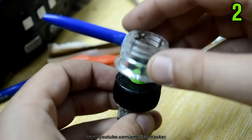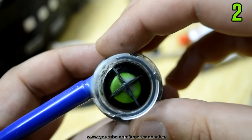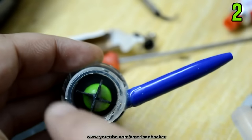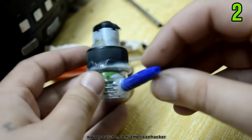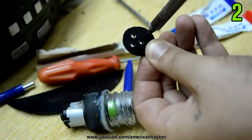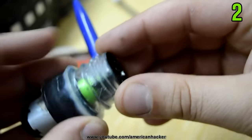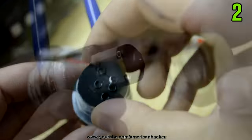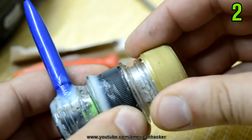When you put the second soda cap, you will need to calibrate a little bit. And just to explain, when the motor kicks on, the water will get a centrifugal direction and push out water through the pan. At the bottom of the pump, I am placing a plastic piece with holes. From here, the pump will pull out water. Before placing the top soda cap, connect wires to the motor. My pump is connected to a USB cable.